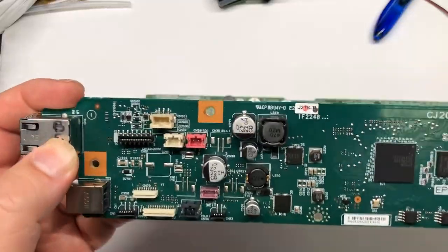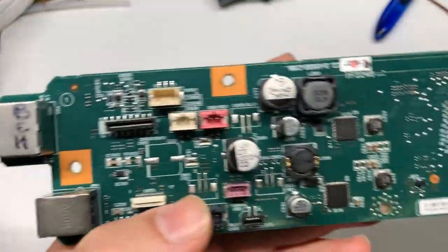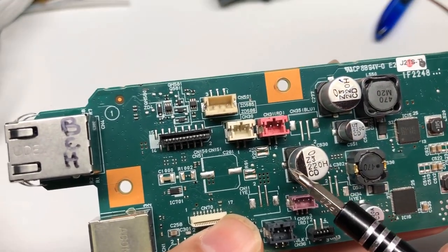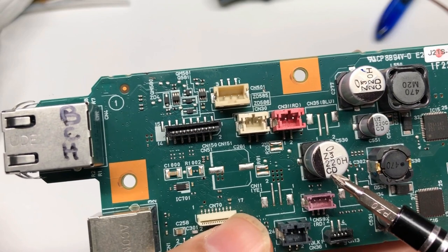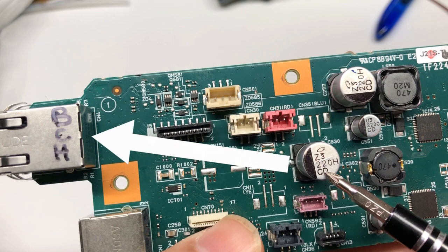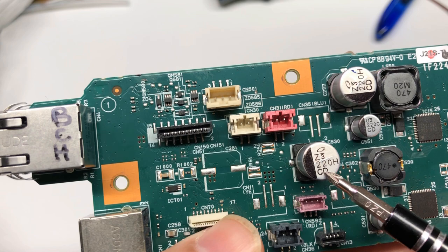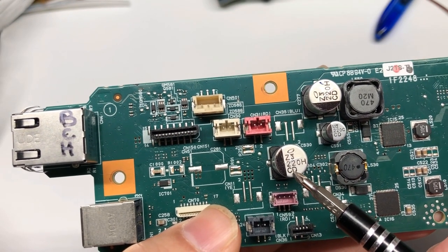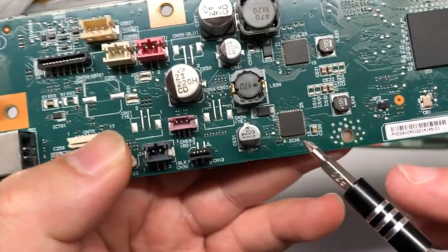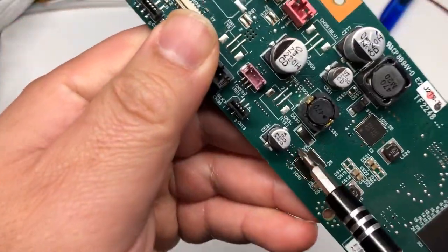If you suspect it's bad, how are you going to replace it? You have to find out what kind of capacitor it is. The black side is the negative and the silver side is positive. Take a picture of the main board, or just remember the negative is always connected to ground. If you put a multimeter between this and ground, it should beep. CD is the model number — this one is CD and that one is CD. This little one is also CD, although it's smaller.